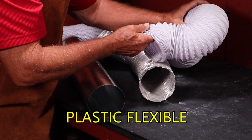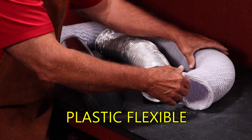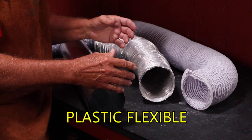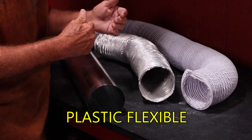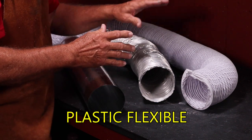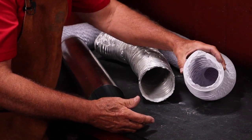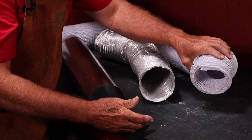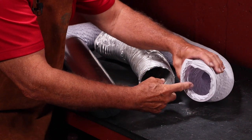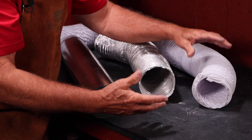The first is a very super flexible plastic duct. It's really great because it will go around corners very easily. You can hide it in corners and it can fit your studio very easily — great for temporary use. The major problem with this is number one that it is plastic and it will melt, and number two, on the inside of the duct work it has a lot of ridges that will slow down the airflow through the duct work.